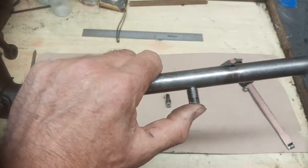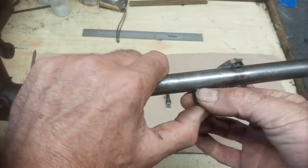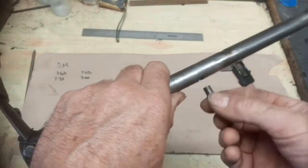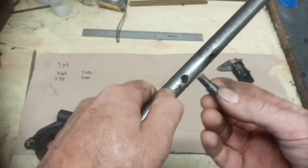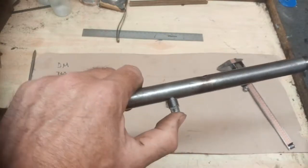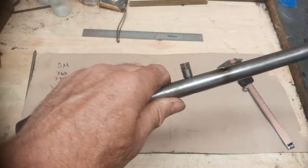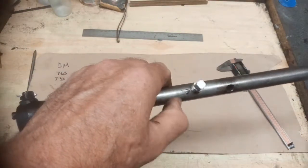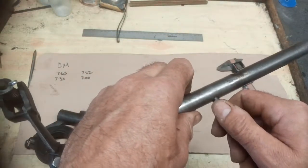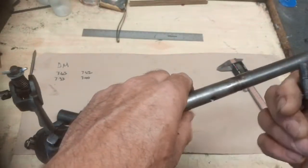This one leaves about half a mill between the thread and the shaft and I can't turn it - so that's locking. I'm going to go with this one because I don't see how a good fitting taper is any weaker than a straight pin. In my mind that's actually a stronger joint, unless your straight pin is a really tight interference fit - and that's hard to achieve.